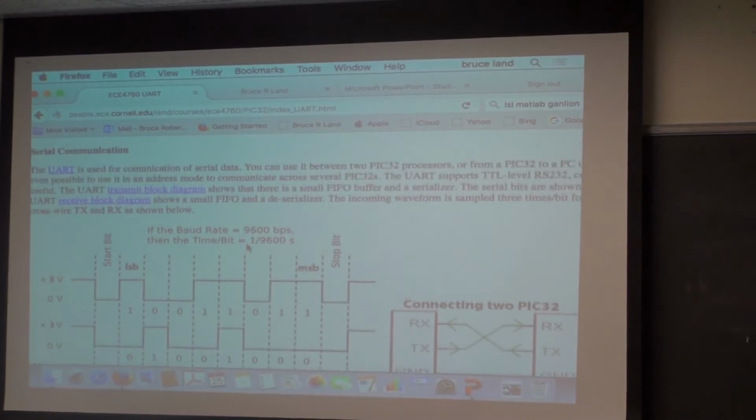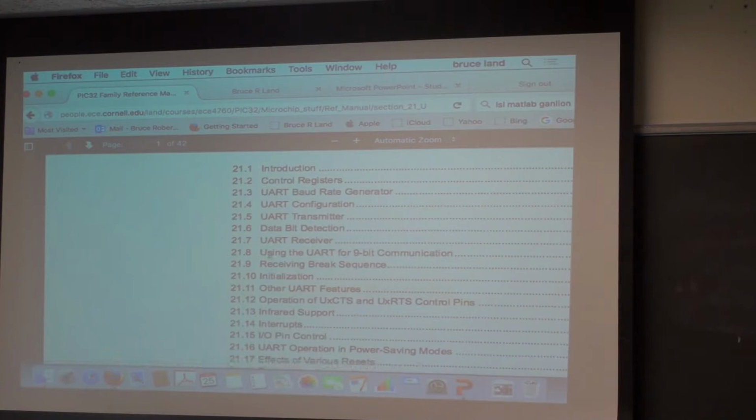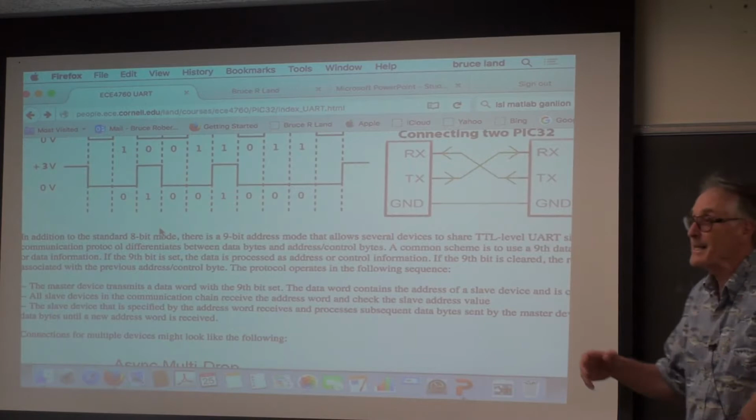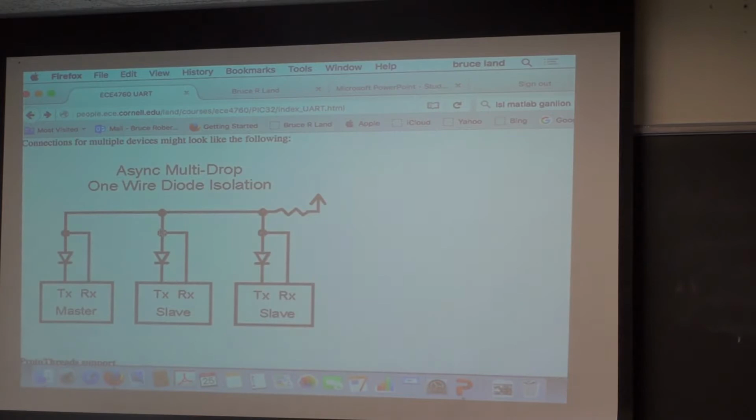I linked up the section on the UART, and if you're actually going to use this, you probably want to look at some of this a little bit, some of the UART baud rate generator. And in particular, if you decide to do something really twisted and use this as a network, you can hook together a bunch of PIC32s in this weird configuration where you have all the transmits and all the receives hooked together on one wire, pulled up gently,